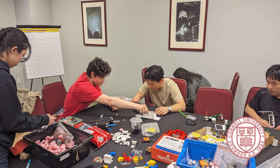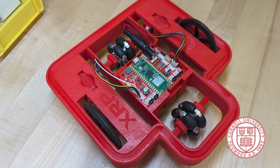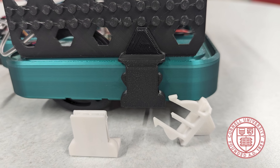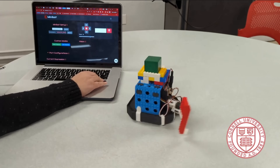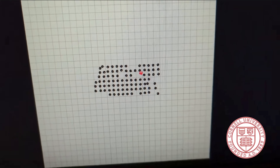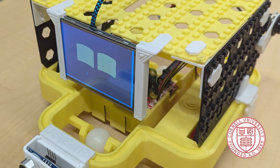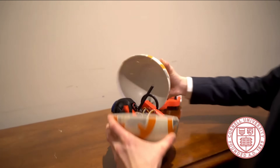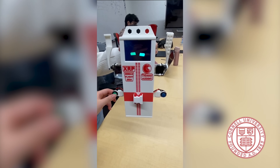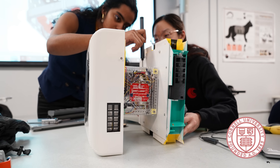Our partner group from Cornell University has completely reimagined various aspects of the XRP. They've created their own design of the chassis with a modified rail system, an overhead awning platform with Lego studs and snap ball connectors, a mini chassis with a much smaller footprint, and an overhead tracking and navigation system using April tags. They've added a Raspberry Pi Zero co-processor to create an emotive display that gives the XRP much more character, vision capabilities, and other features. They've used the XRP to create a functional BB-8 robot, and made an adorable robot that went on a zero-g test flight in preparation for sending the XRP into space.